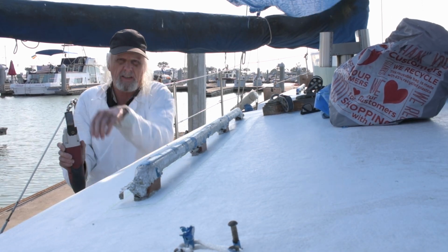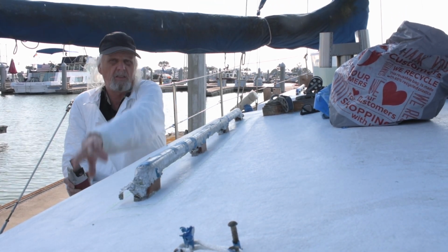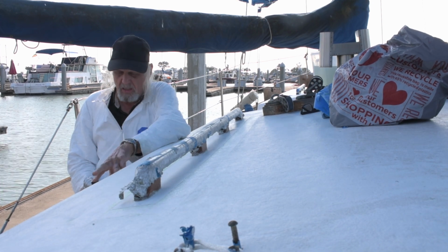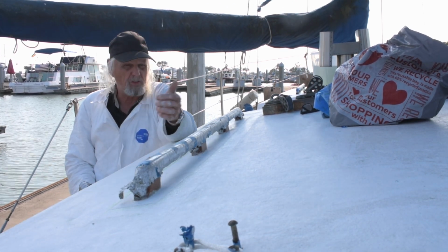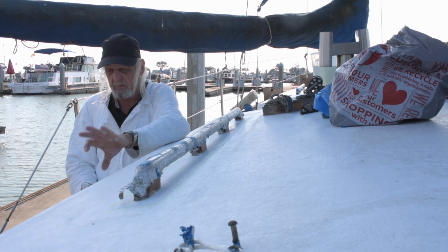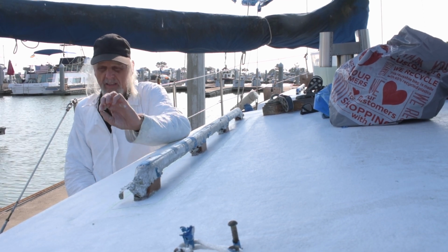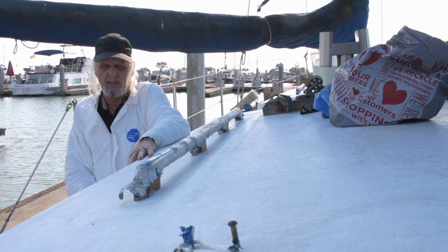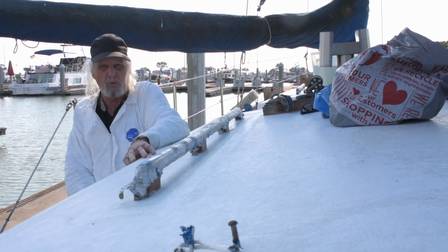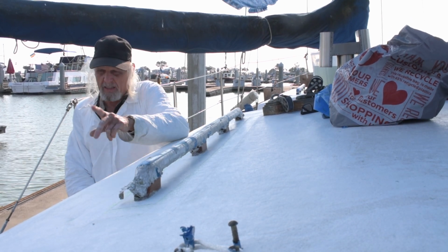When I started this project, I pulled a lot of teak trim off the sides of the cabin here. It was about this wide, top and bottom, and along the back and along the front. And I left a ridge where a piece of teak went in. The back of the boat, which I'm going to show in a minute, is all teak, and then it wraps around, and then there's one flat plank of teak along the back side going up and down. Well, I left that. There's a little bit of an overhang because I decided I wasn't going to put any trim back on. I was debating on whether to do that or not, and decided I'm not going to drill a bunch of holes in my fiberglass that I just laid up so the water can get into it. So I decided I'm not going to put that teak trim back on the back here, so I need to cut that lip off.